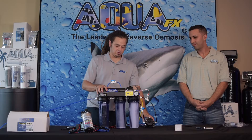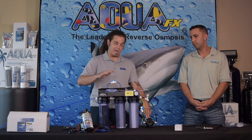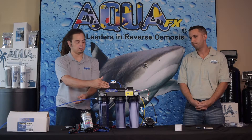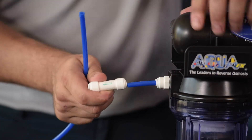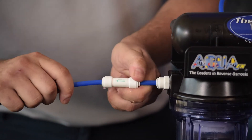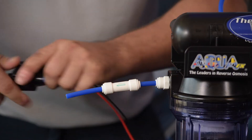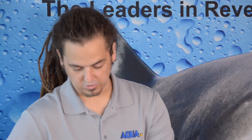I just got my pump installed. We're going to go ahead and install the check valve and the high pressure switch. Ideally we're going to want to go anywhere after the RO membrane; for our purposes we're going to go after the DI. Go ahead and cut the tubing, put the check valve in — make sure you get the arrow going towards the float. Get another little piece of tubing and then insert the high pressure switch. This is a universal direction, it doesn't have a flow in or out, so you can go either way. Then connect the tubing and it goes on to the float.